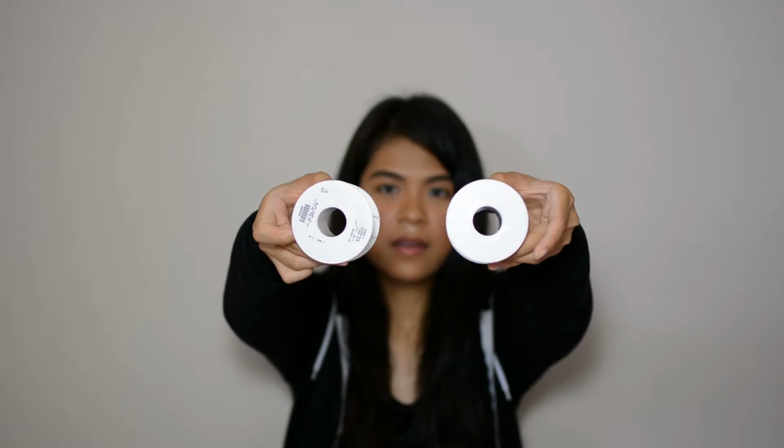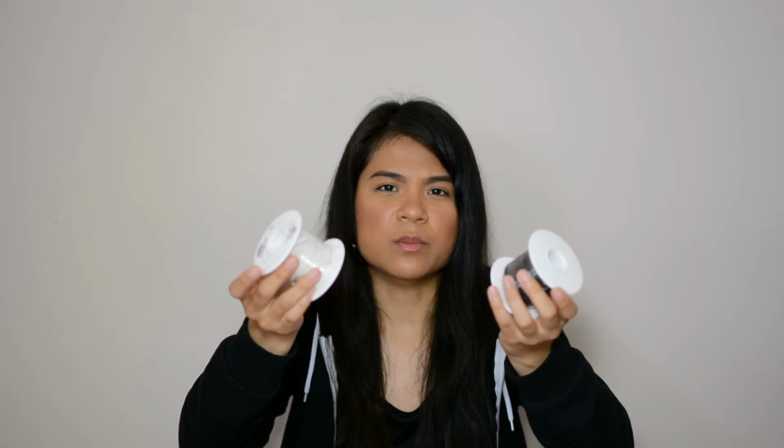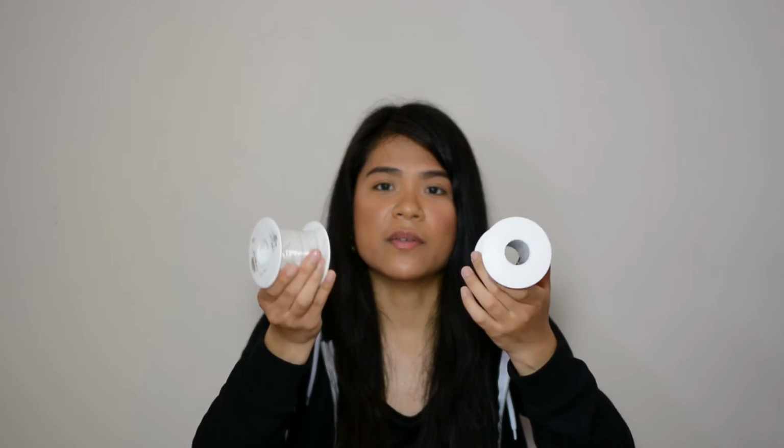Another thing I got was these stranded wires. They're right here. So I got these stranded wires because I prefer them over the solid core ones, because the solid core ones would always break apart when there was a gentle movement or a rough movement, and I always had to resolder everything. And to help with that, the stranded ones always solved that problem, and I never had that problem. So this is why I love the stranded ones.